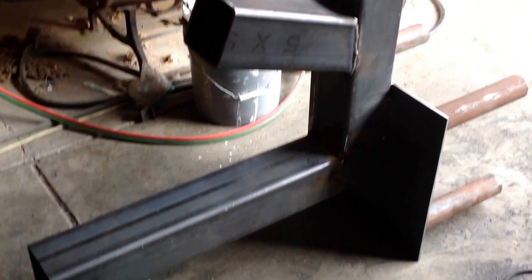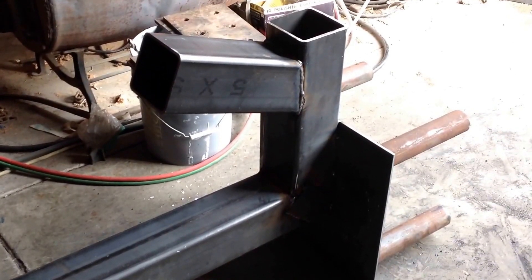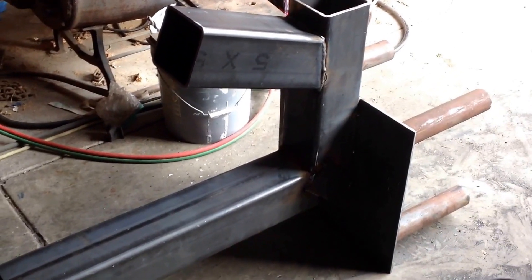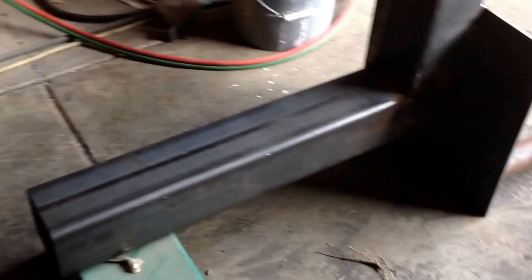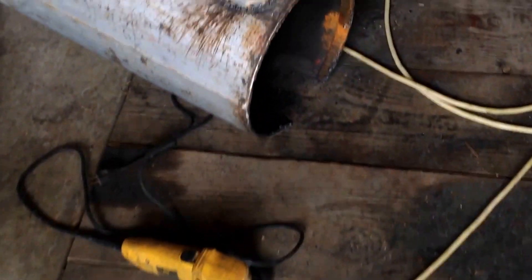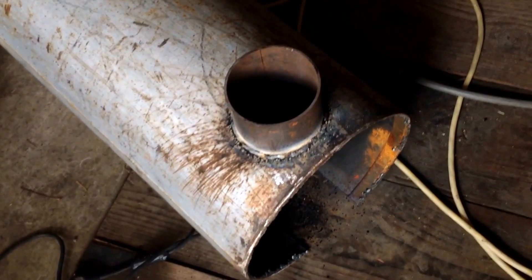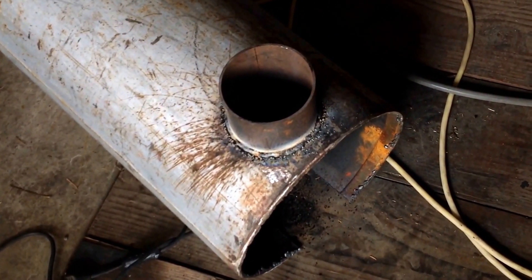I'm making one of these rocket stoves — this is five inch by five inch. I've seen this done and it really works great. There are legs on the bottom, I'm going to put a door right there, and the feeder tubes right there. Right here is my exhaust. I went with a five inch. I found out I had the wrong wire in my welder — that's why I was throwing crap everywhere. Finally got the right wire. This is a propane tank — cut the top off, the bottom off, and got the square hole down there on the bottom.